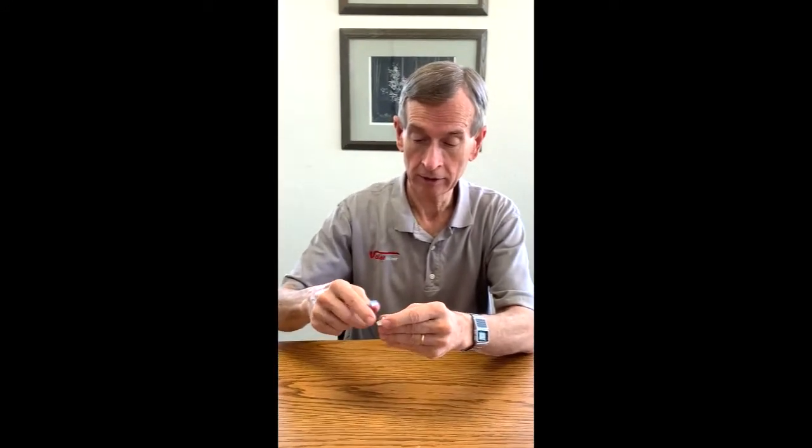I have sawed around the edges to release the glue on the plastic. First I'm going to pry out this plastic piece around the sensor. There's the sensor — it has three contacts on that little plastic piece, and those three contacts go to three contacts on the circuit board. Now let's try prying off the cover.